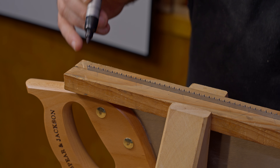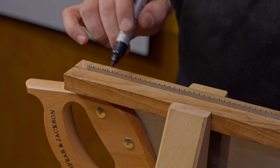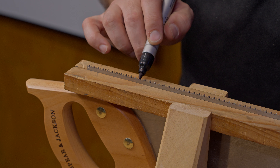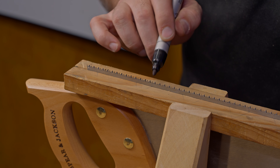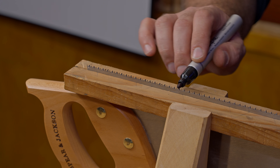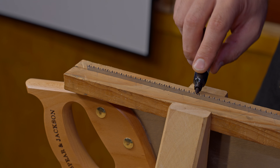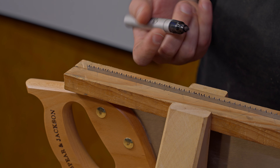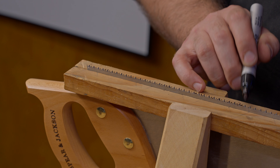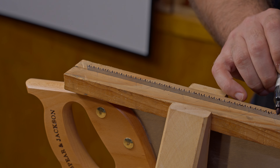When we do this, we can use a sharpie to mark the tops of the teeth so we have a little black dot on both sides. I don't always find that the sharpie is necessary, but if you're just beginning it's a little easier because then you can't lose track of where you're at with your sharpening. Note that on a crosscut saw this will destroy the sharpie quickly, and other people have suggested options like metal marker fluid for that reason.